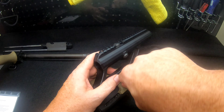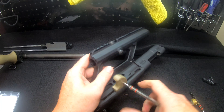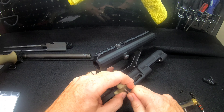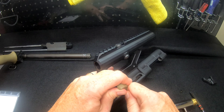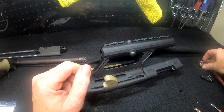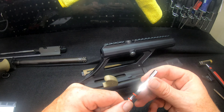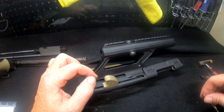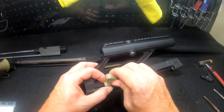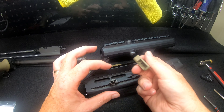I just saw the pin fall. It took just a second to pull that punch out — if you use the quarter inch once it goes all the way through it is going to get stuck; I had to use a pair of pliers and wiggle it back out. Now that the pin's out, we should be able to remove the plastic charge handle — there we go, it pops right up.